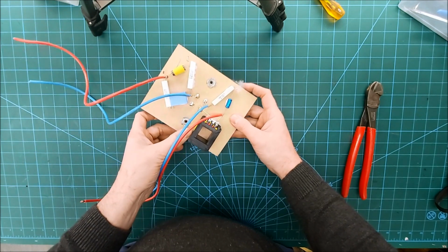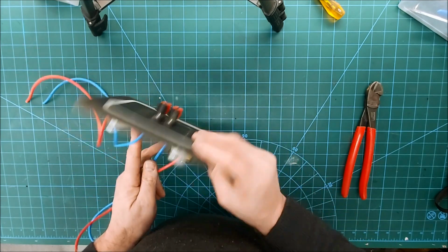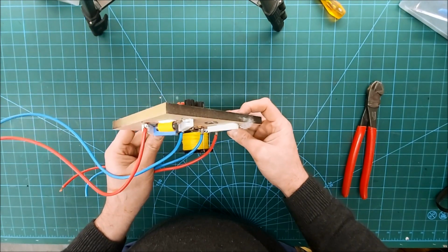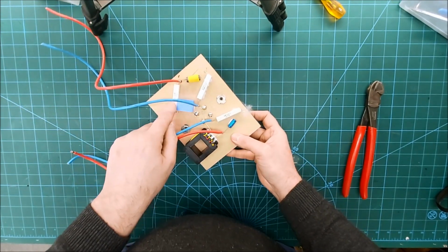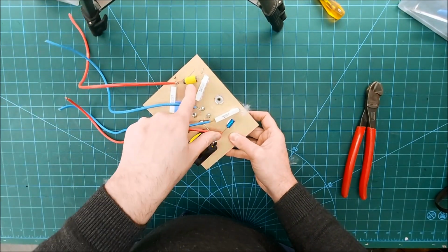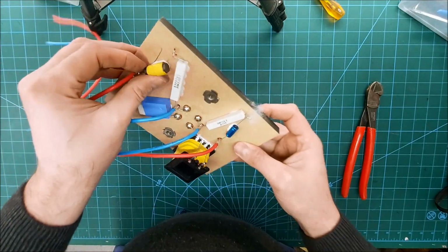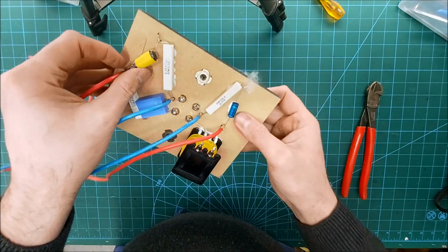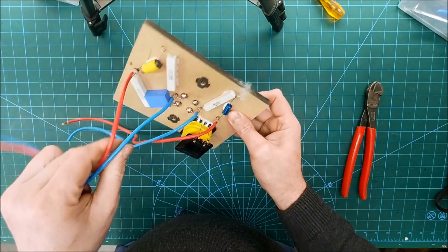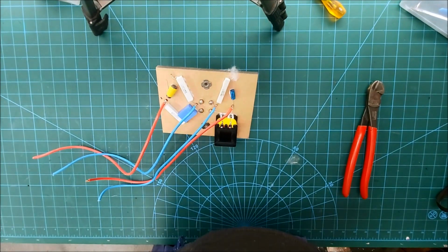And then on the tweeter we've got a second order arrangement again. So in on this capacitor here, which is I think a polycap of some description, 2.2 ohm resistor out to our tweeter. Tweeter's connected in phase, and then a teeny inductor down to ground through a 2.2 ohm resistor. So yeah, let's check them out and see how they're holding up.